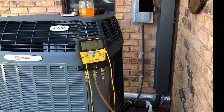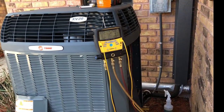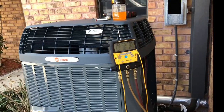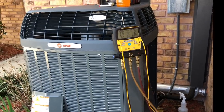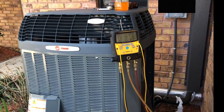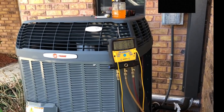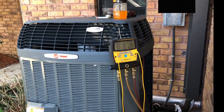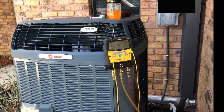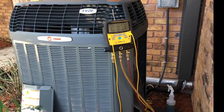My numbers are a bit off over there — I'm looking for 10 degrees of subcooling, so I'm about to add some more. The reason you want to put it in charging mode is because it ramps up the outdoor unit and the blower — I think it ramps the blower to about 85% and the outdoor unit to 100%. Don't just put a Trane variable speed on cooling and turn the temperature down; that won't cut it. You have to go into the Technician's Menu, go to Test Mode, then hit Charging Mode. It'll automatically cut the system on and ramp everything up. Let it run for at least 15 minutes.